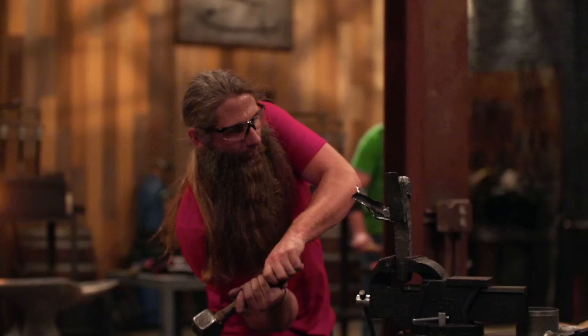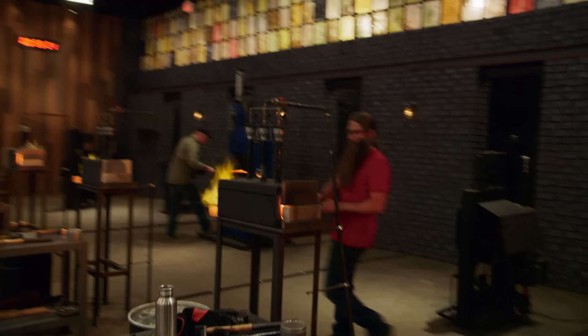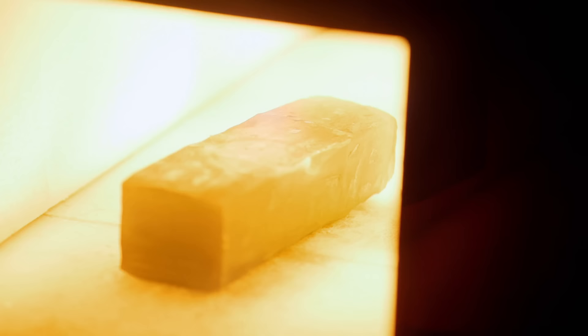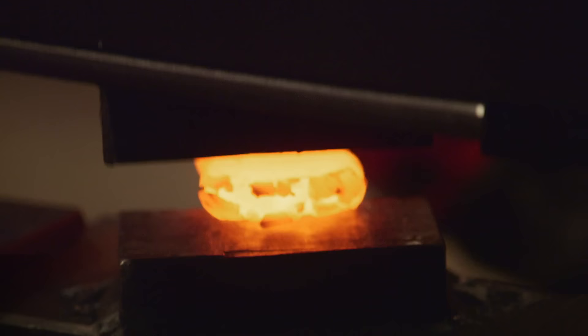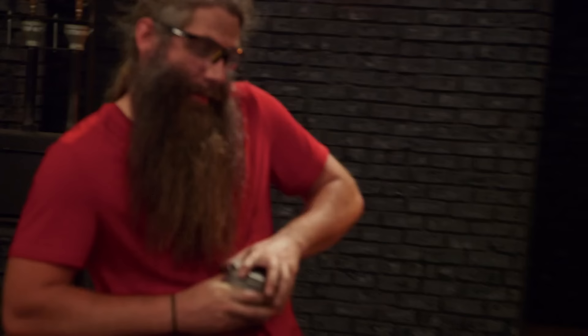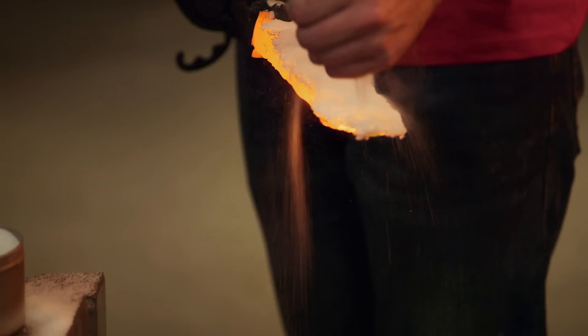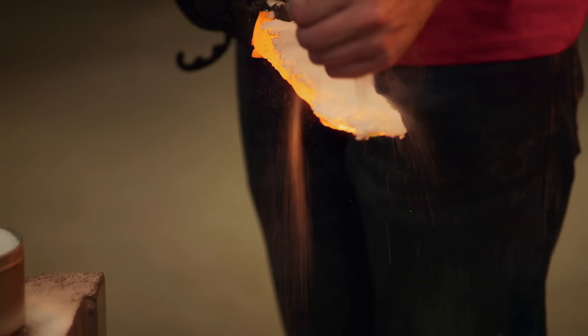You have just 60 minutes remaining to finish your blades! I finally get the outside of this thing off, but the chromium in the ball bearings forms its own type of strange layer if it's exposed to oxygen, and that can cause delaminations. Looking at my welds, that looks like pretty much exactly what happened. It looks like Mike's pulling out flux — that's not a good sign. If Spicy Mike's pulling out flux, that means there's cracks or issues in his billet. He put flux on the whole length of that billet, so there's probably flaws going all the way down. I can't turn in a blade with non-welded spots. It does not look good. Mike's screwed.